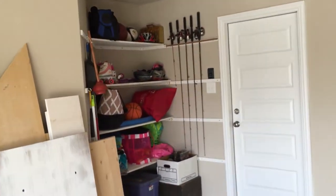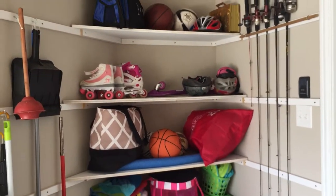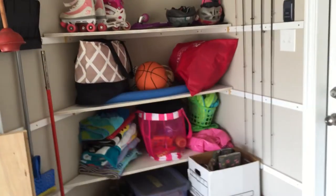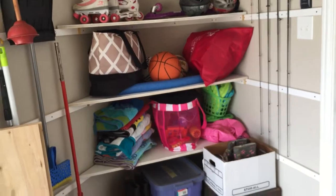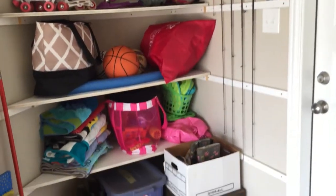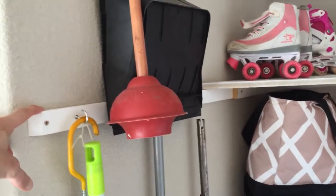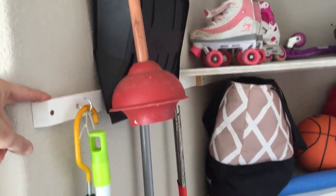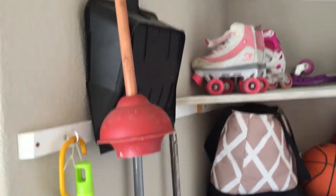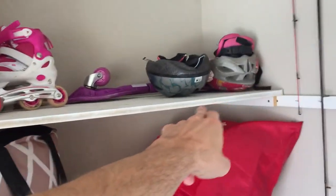In this garage there was an interesting little jut-out in this corner, so I made use of that by installing some shelves. It seemed to make sense for the space — it's kind of awkward, the wall goes in and then goes flat and then comes back, so there's a good short space to do some shelves in. I've also got my fishing rod organization there. I just cut these boards down from two-by-fours — I didn't have any one-by, so I ripped some two-by-fours, screwed them into the studs, and added some hooks to hang various things. These strips continue all the way to the wall.